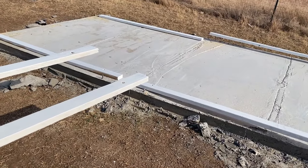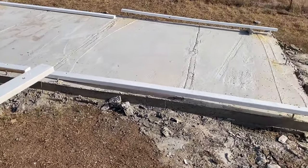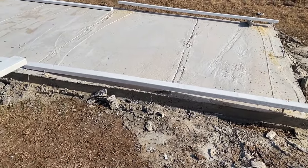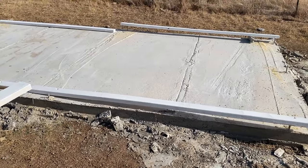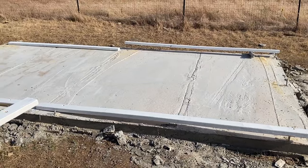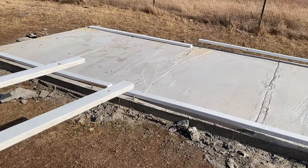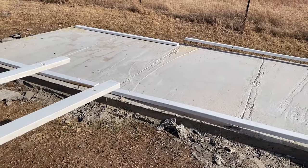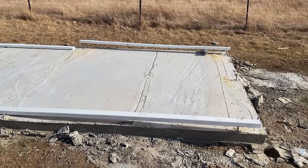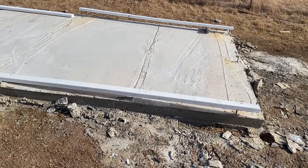It's coming together — it just takes time, you don't want to rush the process. Compared to the other greenhouse I'm taking a lot more time making sure the cuts are right. The last building was nowhere near square and nowhere near level — I pretty much built that frame with 12-by-12 inch boards and just laid it based on the contour of the ground, so it was definitely lopsided. This one has a little bit of slope to help the water run off. You can see how rough those joints look compared to what we're doing now, but it will suffice.